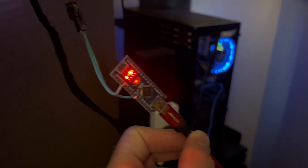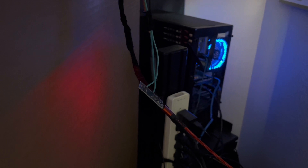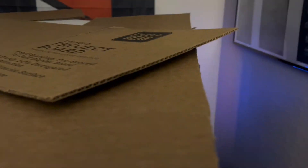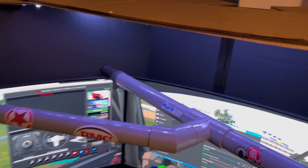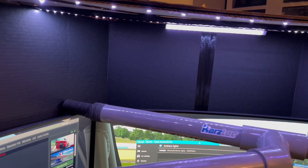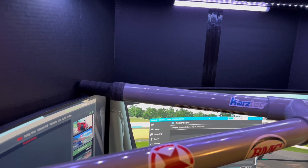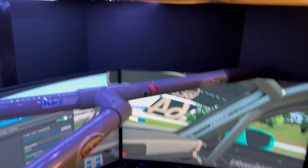The ground and the DIN go into one section, and the positive and negative go to the other section. There should be a USB cable connected to that, so you'll have two USB cables running all the way down, and both sections independently connect back into the lighting source. As you can see, the two leads run around back and up into the board. There's also an extra bar underneath that is not controlled by the Arduino — that's just for extra lighting when filming, controlled by an app.